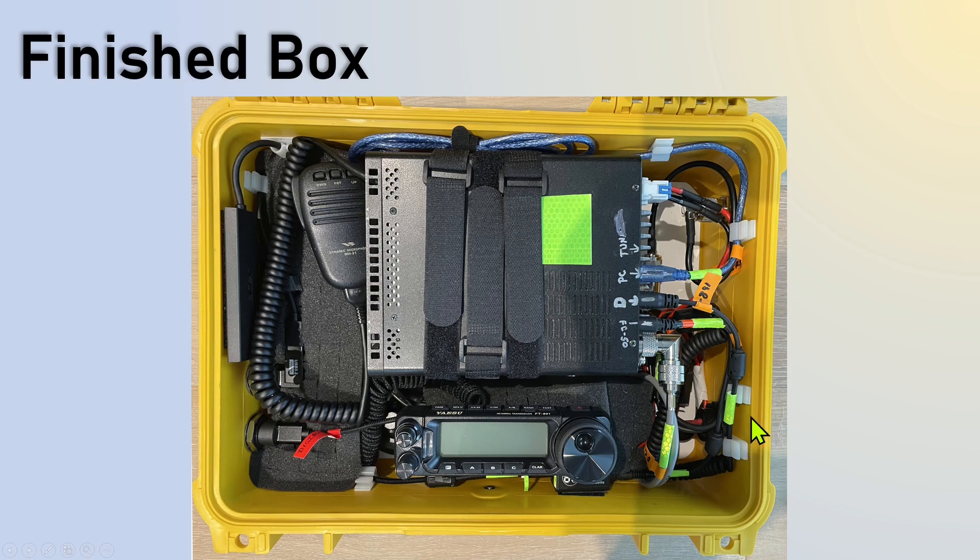Over on this side is the power connection. I tried a USB hub because I thought I could take the two DigiRig wires through a USB hub extender and only have one USB port coming out, but it didn't work, so I had to put an extra one in. I was able to use my mouse dongle in there though — that's trial and error. I put in a lot of ways to reduce tension on the wires and ports so they're not being pulled or bent, using 3M self-adhesive wire clips as well as 90-degree elbows to protect the integrity of each port.